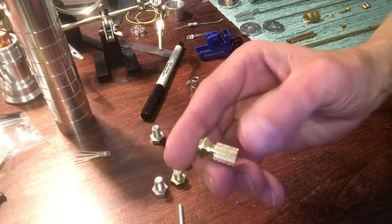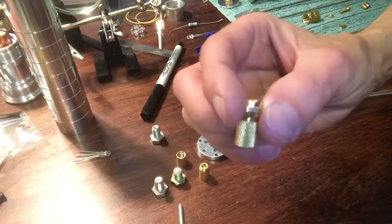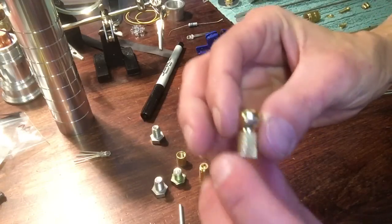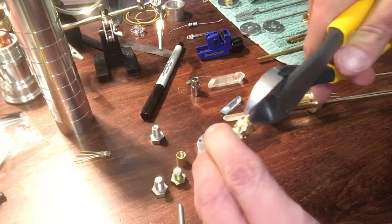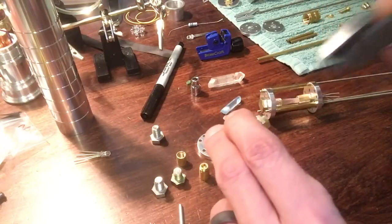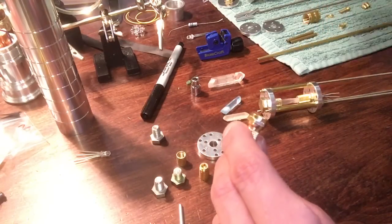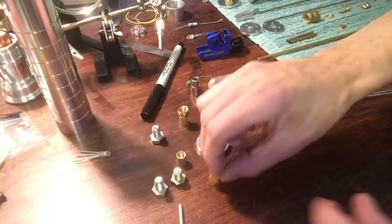As you can see here, this is a coaxial cable end — the threaded variety. What I do is this top section here that spins, I actually take some mini bolt cutters and snap that sucker completely off. Once you've snapped it, you may need to get some needle nose pliers and kind of pry it off. When you're all finished, this is what it should look like.